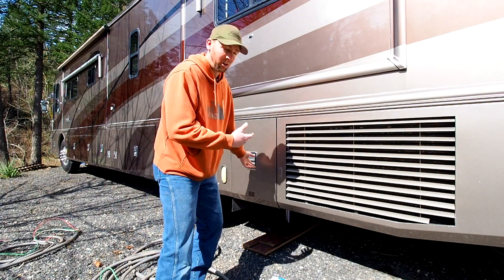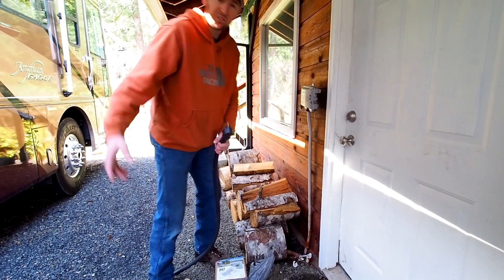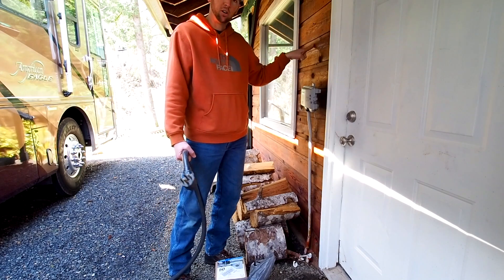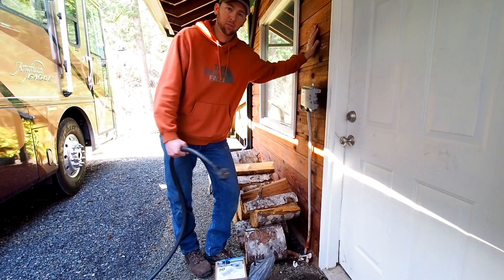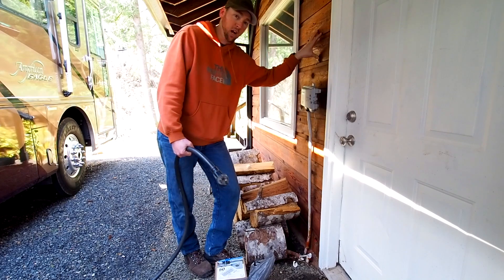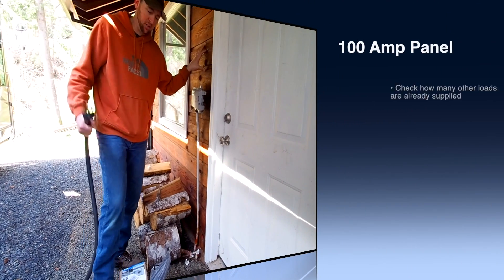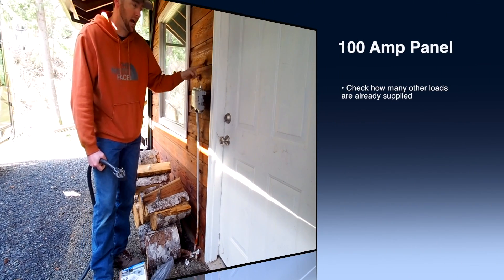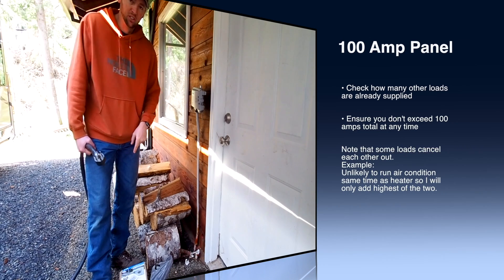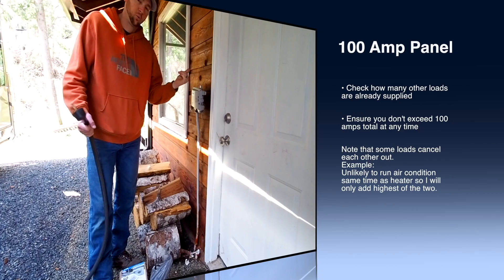So in our new RV, here's where our power goes in. I ran the cable from the RV over to the garage — right behind this wall is our main power panel, a 100-amp panel for the garage. It's actually a 100-amp panel coming from our house's 200-amp main panel. All that matters is we have a 100-amp panel. We're going to put a 50-amp breaker in, so we just need to make sure we don't have too many high-amp loads. In our case, the 50-amp breaker will probably hardly ever be used anywhere near 50 amps, so we're good to go.